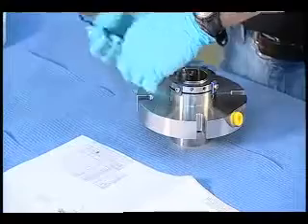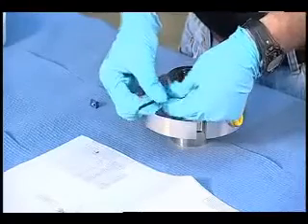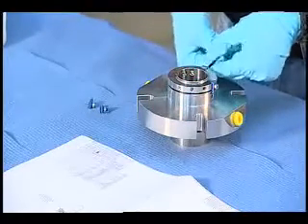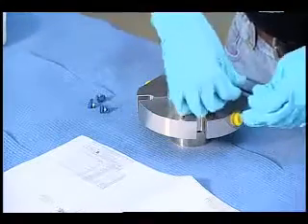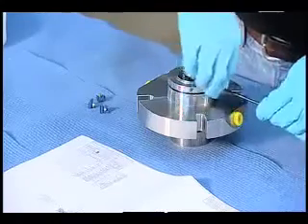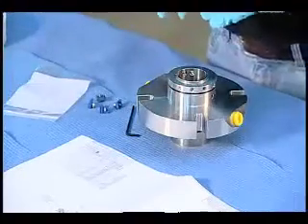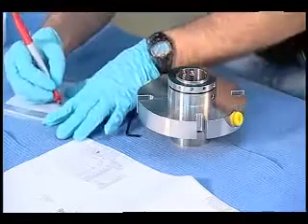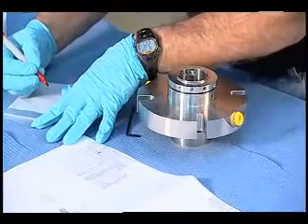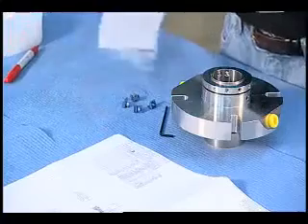The objective here is not to disassemble the seal as fast as possible and show off in front of the customer about how good we are with an allen wrench. The idea is actually to inspect the parts as you go, so take some time. Once we get all of these off, I'm going to tag them all and put them in the same bag. I'll label these as screws number 19 and setting fixtures number 18.